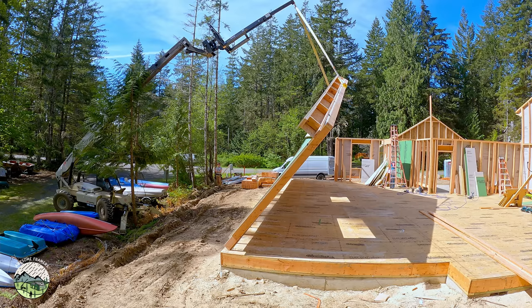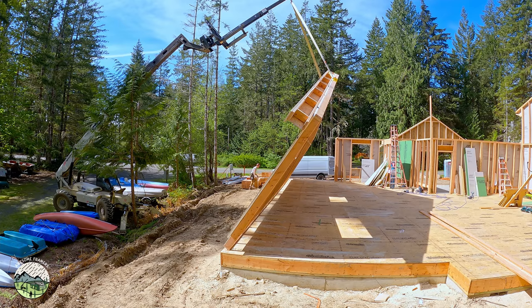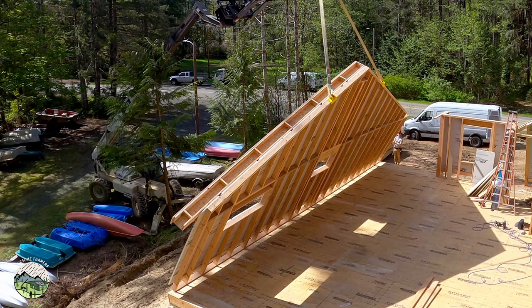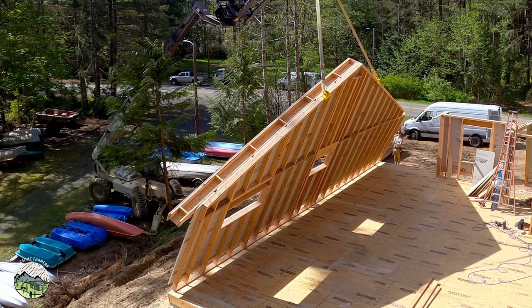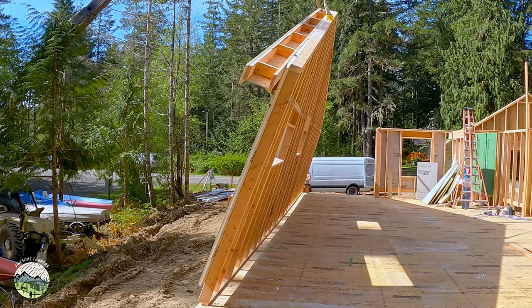Take these lifts slow. Shane's off to the side, we're all prepped to brace it. I'm in the machine because I'm experienced. Kyle does all the signaling — we've been a two-man crew for 15 years and that's just how our roles have worked out. Kyle's keeping an eye on everything. I'm making sure I don't hit any power lines or boats, just nice and easy on the controls. You've got to feather the accelerator to keep the pumps going, especially as the machine gets older. We have a 30 foot strap. Keep the pick points so that your angle off vertical is 30 degrees or less — that way you get the full rating on your straps.